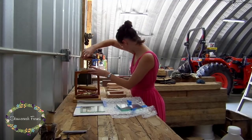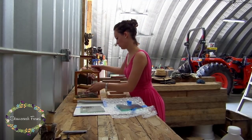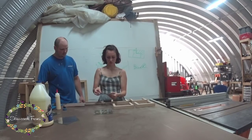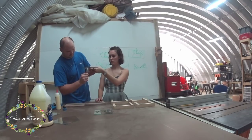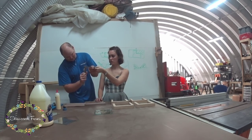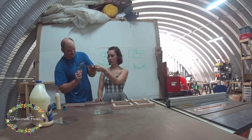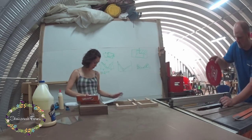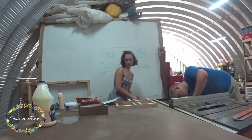So here I'm checking on the flowers, and I didn't really like how some of the flowers dried, so I actually did a second round of flowers. The flowers for this project fit between two pieces of glass, and then the whole assembly gets slid into a dado system. So we had to figure out what thickness to make the dados, and here we're measuring two pieces of glass with some flowers in between, measuring all four sides and trying to get some average thickness.